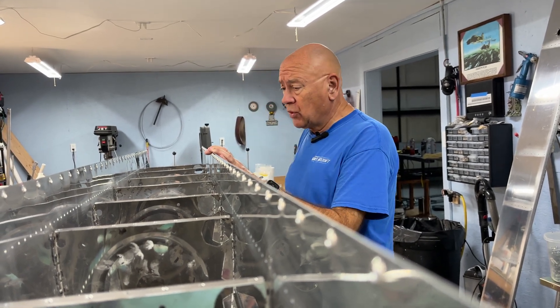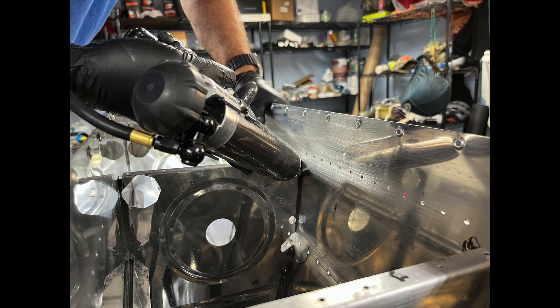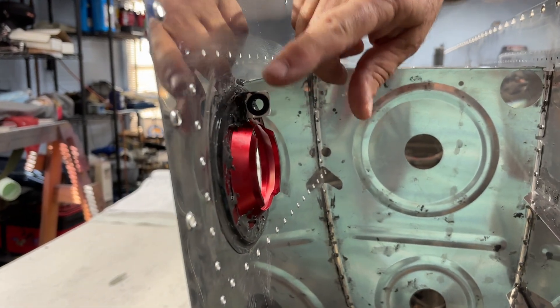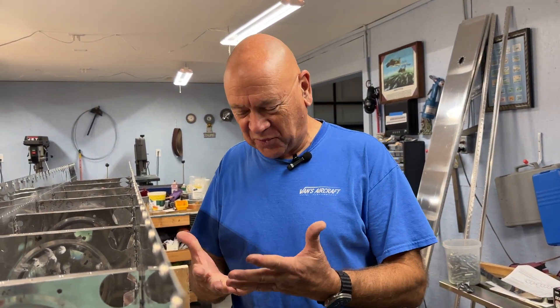Now what I'm going to do is use the gun with the ProSeal and seal along all the edges and the leading edge of each rib as per the instructions. I did attach the vent line clip out here in the outboard right beneath the fuel cap, so that's all done. It's a mess with the ProSeal - it's just kind of nerve wracking. Everything gets wrecked. Wear old clothes. Although this was my Sunday go-to-church shirt, I got it all dirty. Thanks for watching.